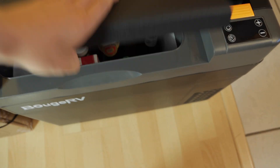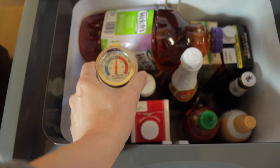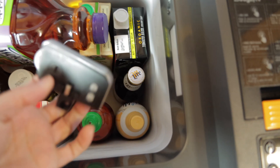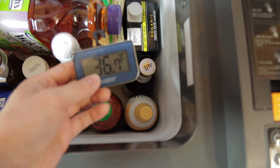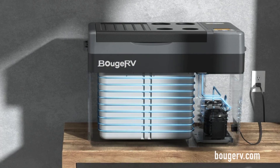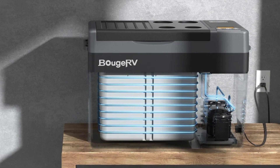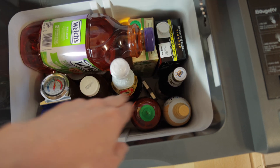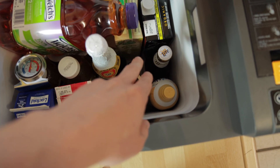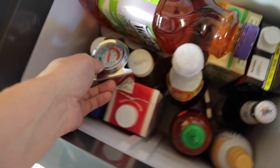Let's check the final temperatures. This here is showing a little bit above 30 degrees. The bottom is at 36 degrees. There are coils wrapped around the exterior of this basket, but I don't think the bottom has any coils running across. So any thermometers towards the center of the basket are probably going to read warmer — as you saw, that was about 36 degrees — whereas this one read closer to 30 because it's near the edge.